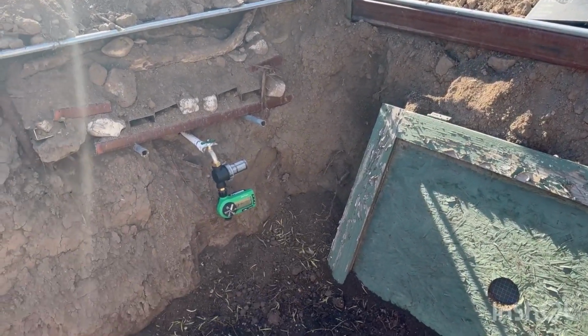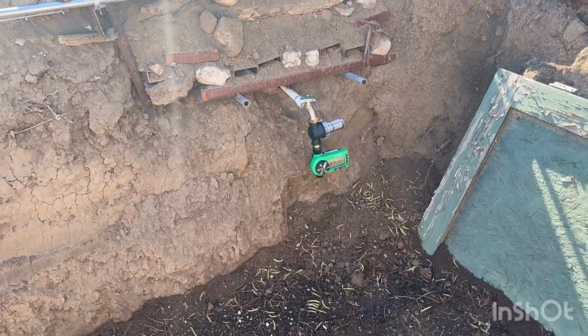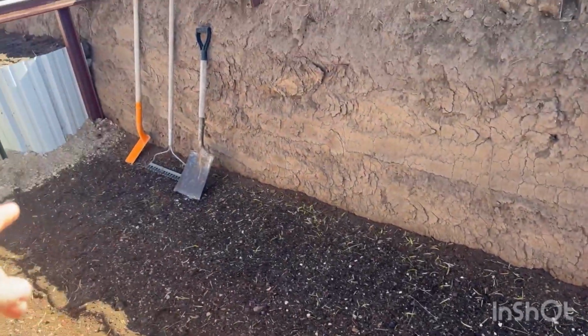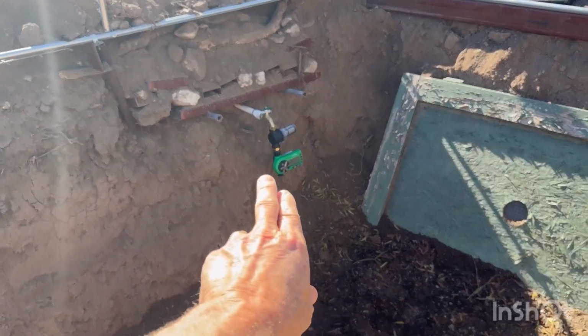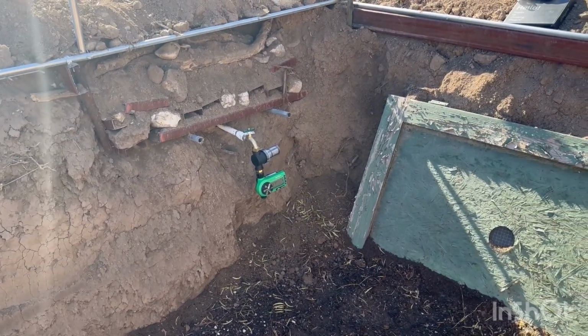In fact, when I put the pressure regulator on in town, I couldn't get enough pressure to fill out my hoses when I ran them all the way down. The first few would water real good and I wasn't getting anything down there. And I took the pressure regulator off and I had plenty of water just fine. I didn't have any blowouts on the end. This may be a spot where I should use a pressure regulator, but I'm going to start off assuming I do not.